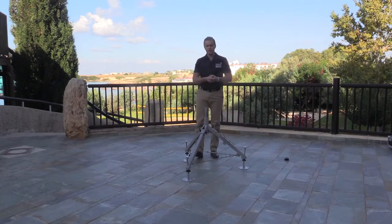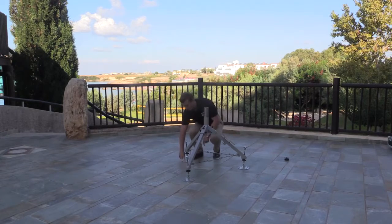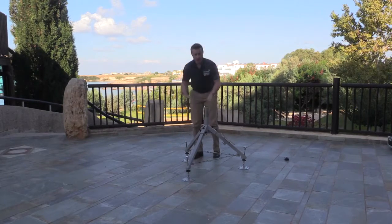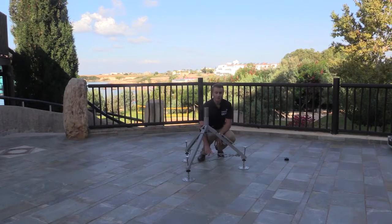We're now almost ready to start placing the antenna on top of the unit, but there are a couple more things to do first. Depending on the type of ground you're located on, you will need to stabilize or ballast the tripod and there are a couple of options. The kit provides a number of stakes if you're on soft ground so you can anchor through the holes in the tripod pads. Another option if you're on hard ground is sandbags or water bags that you can place over the tension straps to keep it in position.